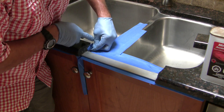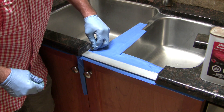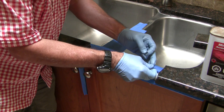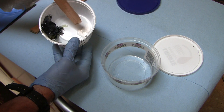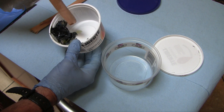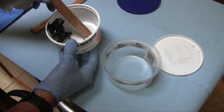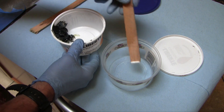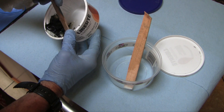I'm carefully taping around the stainless steel for the sink so that if the sink has to come out one day it won't be held in place by the glue from the granite. This stuff smells like Bondo. That's the hardener in white right there, and this is my color-tinted glue, and I mix the two together. We've got way more hardener than we need, so I'm just going to take a little bit of it. That should be enough and then we'll mix up the glue.